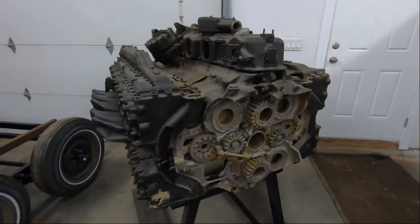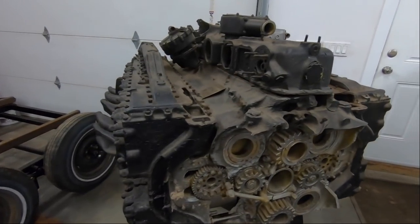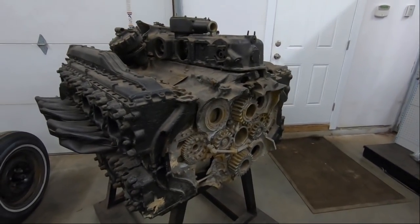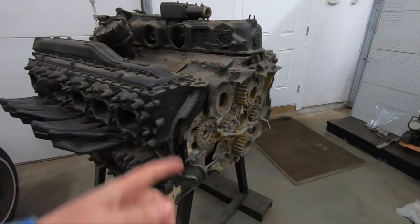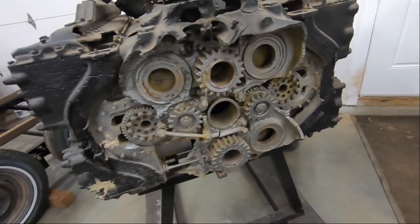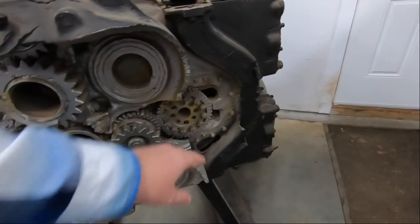It's amazing to stand behind this and see it. What you'll notice first off is that the gear reduction is snapped off — that's pretty typical when Typhoons crashed under power. They swing a 14-foot diameter propeller and the first thing to go is here. The prop shaft would go in this hole. This is the upper crankshaft, lower crankshaft, and these are the drives for the sleeve mechanism on either side.